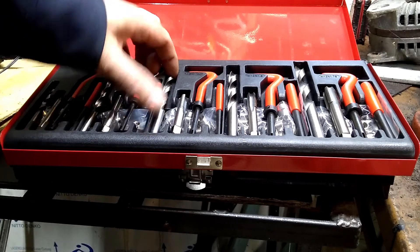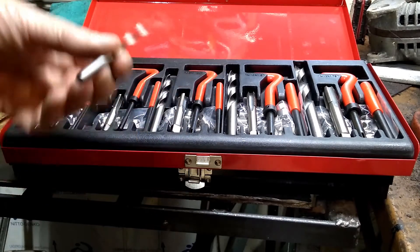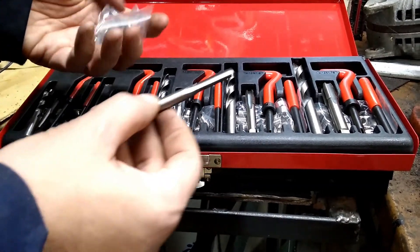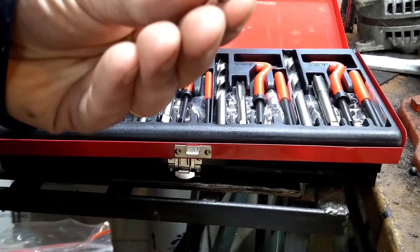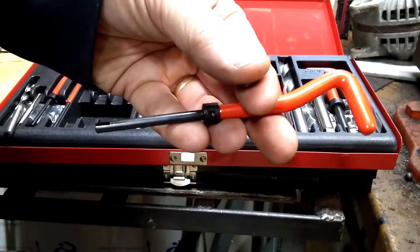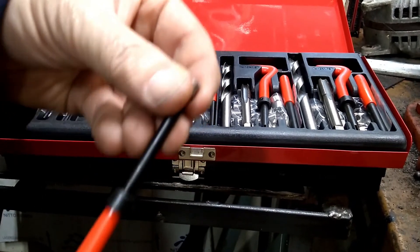All we have to do is drill it to oversize. So let's say this one is a six millimeter — you drill it oversize with the drill bit that's provided, then tap it with a tap that is the size of these inserts. So then we have an insert — this insert is just a coil of wire. You tap it and then you use an insertion tool to thread the insert down into the larger hole.